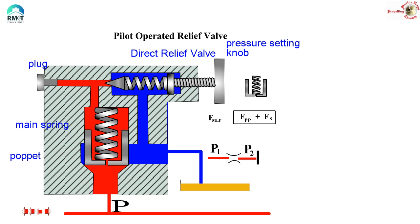What we are seeing here is a pilot operated pressure relief valve. This forms a very important component of many circuits used in marine machineries, and it is quite important to understand the concept and working if we desire to have a very good shot at troubleshooting. It is the beginning of hydraulic controls at the very basic level, and you may see it used in circuits like cargo valve operating power packs, or in any engine, or in Framo. In this video we will understand the concepts and working and also see it being applied in a real-time circuit as used on board.